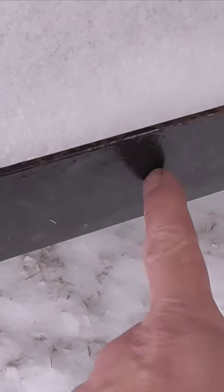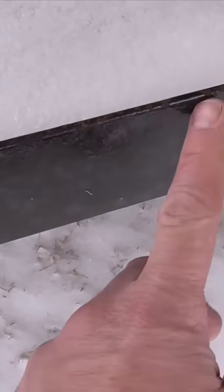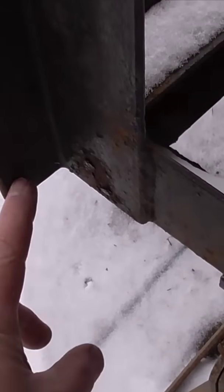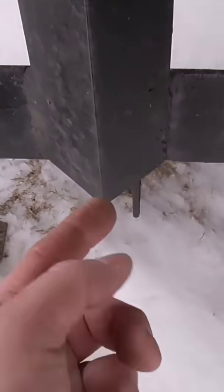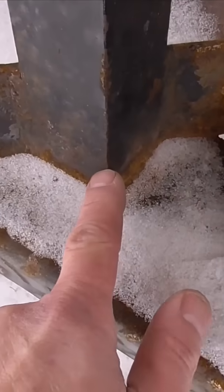We're going to make some stake pockets. We can weld them to the trailer, and then we can weld the rub rail to the stake pockets. We'll be able to get a vertical weld here. So I'll put another stake pocket here. We'll be able to get a tack top and bottom on this. We'll do another stake pocket here. Tack top and bottom here.